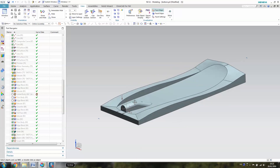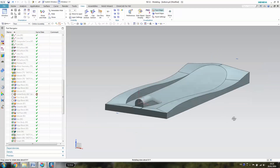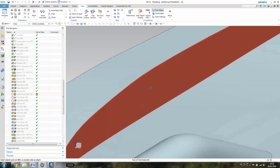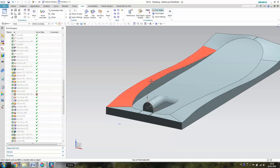Later on, we understood that this is not the best solution. Because when you spread the carbon fiber, you will create a natural blend edge. You see that you have the flange where you spread the carbon fiber, but at the angle it creates an edge blend which is not good — because we want a sharp one. The first time we made a blend edge, but for the top part we just made it straight so we don't need this. But I still want to keep this idea as it can be a good start.